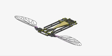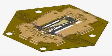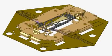Mobi is fabricated as 2 parts, the actual machine components, and a surrounding mechanism called an assembly scaffold. The assembly scaffold's purpose is to link all complex origami folds into a single motion, like a pop-up book. Let's take a more detailed look.